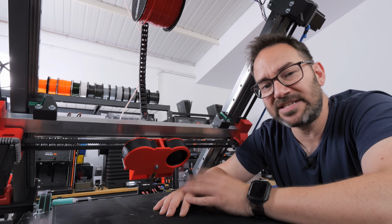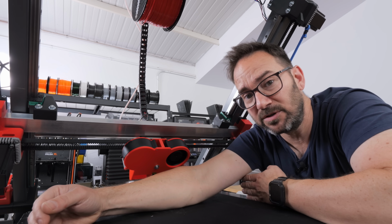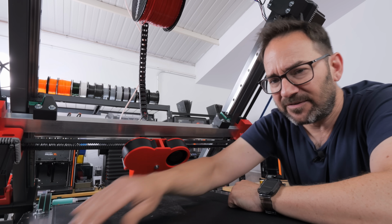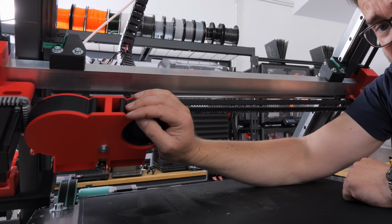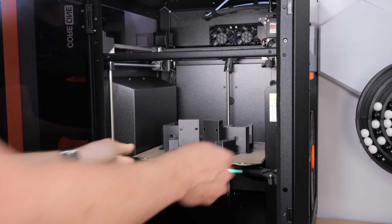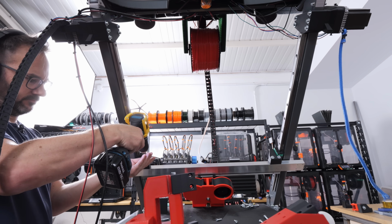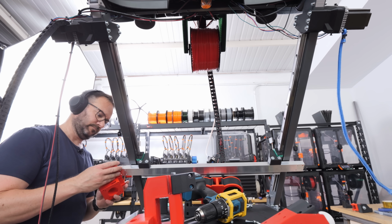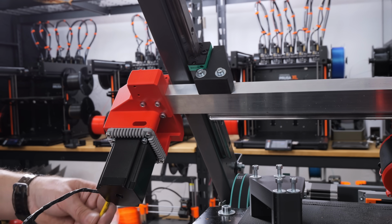Of course, this was too easy, because I mentioned that I was trying to maximize the amount of belt that I could use, and now these fans in here hit the X-axis motor. So I had to modify the motor bracket, and of course I will never let go of a good ADHD side quest. So I also reprinted all the parts of the machine in ASA, because at the speeds we're going to be trying, this thing will shake like a washing machine full of bricks.